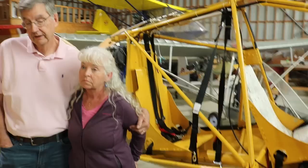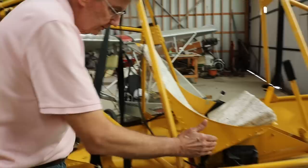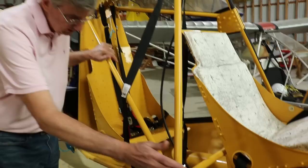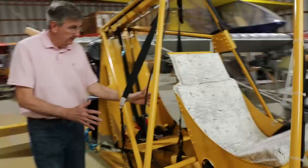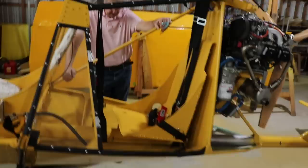After building what we called the Chinook DR in honor of Dan Reynolds, we decided to take another look and fix some of what we perceived as problems in the U.S. market — namely that U.S. customers are larger people who weigh more. We wanted an airplane more like a cub or a champ. So the Chinook SJA has a 700-pound useful load. We increased the cabin width to 38 inches and kept that width through most of the rear cabin, giving a much larger rear cabin and a much larger rear door for cargo or passengers of any size.